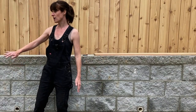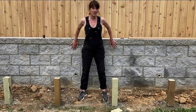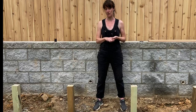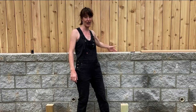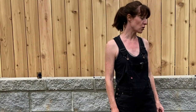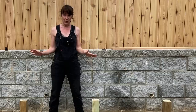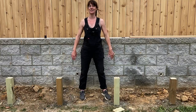My project is a raised bed alongside an established retaining wall. If this was going to be a standalone retaining wall, there are a few modifications I would make. First, I would use something much thicker than the 1x6 inch cedar boards. Second, I would put in a perforated pipe along the edge — I'm not doing that because I know there's already a perforated pipe right behind this wall. Also, I would backfill with gravel, but because this is a raised bed and I'm controlling the type of soil I'm using, I'm not going to do a gravel backfill either. You can do this same style for a retaining wall with those modifications, but mine is just going to be a raised bed against an established retaining wall.